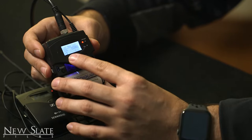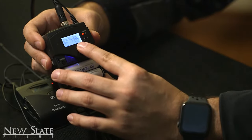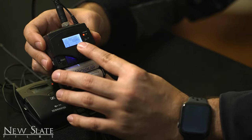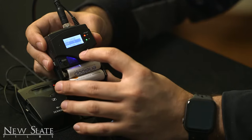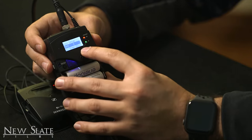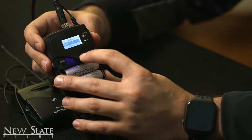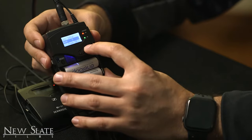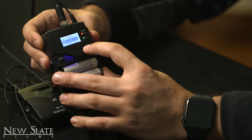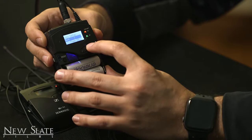This scan is going to show us all the available frequencies at that location. In this case, this lab is the A set, so it goes from 516 to 558 MHz. Depending on your unit it might be a different set, but it doesn't matter. Let the scan complete — it takes about a minute — and then you'll have some frequencies to choose from. Once the scan is complete, you'll see different banks and under each bank how many channels are free. Because I'm in the suburbs there are a lot of free channels under the different banks — just choose one.